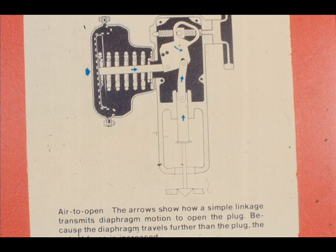An increasing air pressure on the diaphragm of a reverse acting actuator again moves the plate stem assembly from left to right, causing the main lever assembly to rotate in a counterclockwise direction. Now the counterclockwise rotation of the main lever assembly causes the link and stem connector to lift.